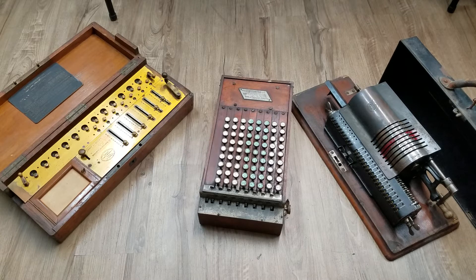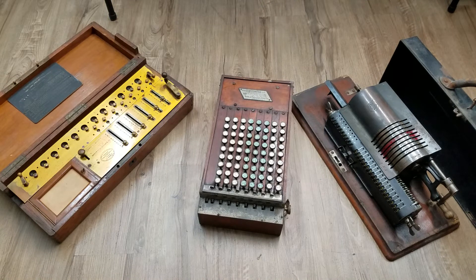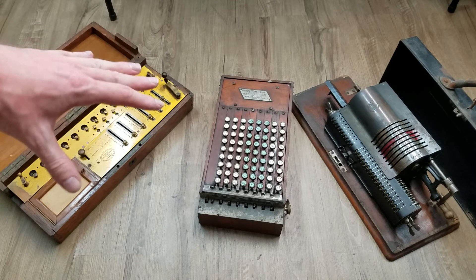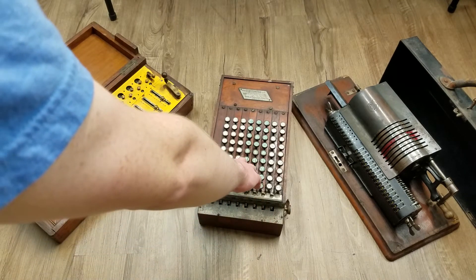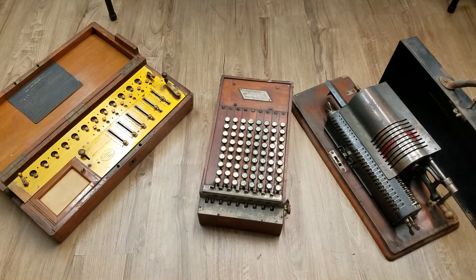This is a pinwheel-type design — depending on where you set the levers determines how many pins stick out of the main drum in that column, which determines how many positions it drives the accumulator forward. It has both an accumulator and a counter. The comptometer does not have a counter, so the way they instruct you to do division actually ends up with the counter being built up in the same register as the calculation. As you divide on one side of the keyboard and move across, the counter is built up in the upper digits while the division happens in the lower digits — they make that one register do double duty.